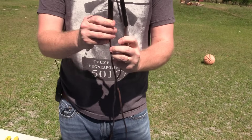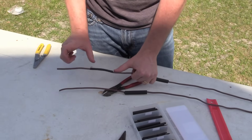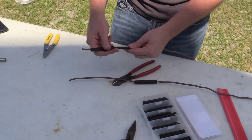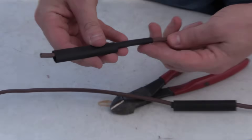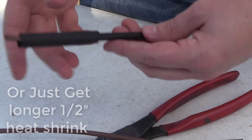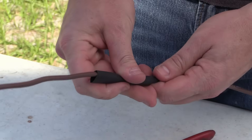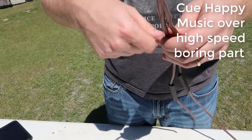Now I've got that well out of the way in both directions. The reason I did that is so the quarter-inch can cover where I stripped back the outer sheathing, and then the three-eighths will actually cover the splice. The end configuration will be something like the splice under the three-eighths, with these two overlapping each other, and then the quarter-inch covering where I stripped back. That gives me plenty of room to work, and when you strip your wires back, put the heat shrink on them as well.